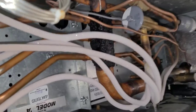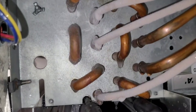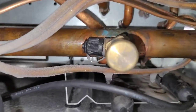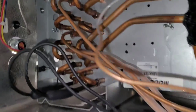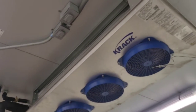Here's a better look at how it's frosting up — it shouldn't be like this. It should be more even. If it's gonna frost it should be consistent and frosty over here as well. Now with the leak found, I'm gonna add some refrigerant to it. Looks like we've got a valve right here — pretty good little spot. I've added some and you can see my frost is disappearing from the capillaries, slowly but it is disappearing. That's more like it. Alright, well I'm wrapping it up now. I don't know if this video is gonna do anybody any good but if you watch it I appreciate it — later.